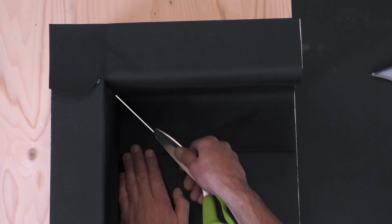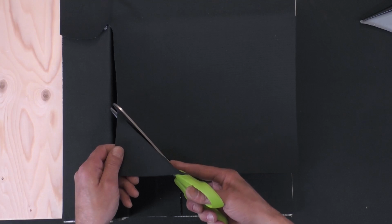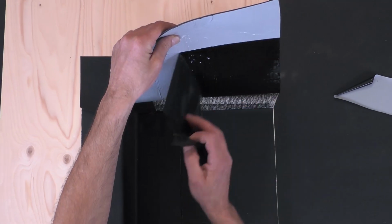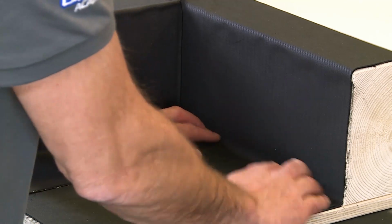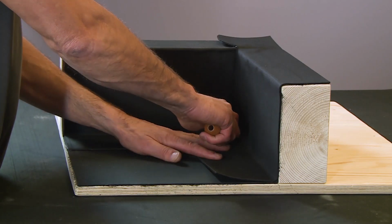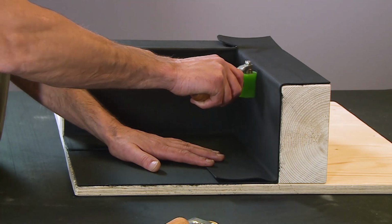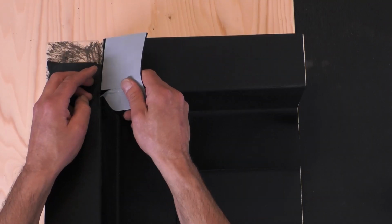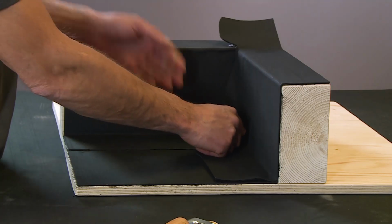On the flashing, cut the base to a mitre. This is slightly curved. The PE film to the upstand is removed. Using the penny roller, ensure the membrane is firmly in place. The silicone roller is then used to ensure there are no creases or air pockets. Remove the PE film from the flashing and weld to the field area from the bottom.